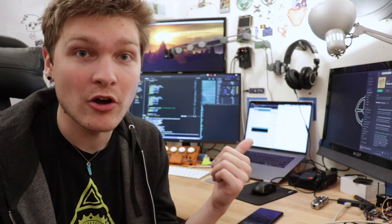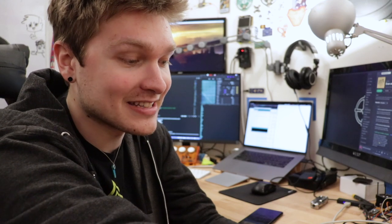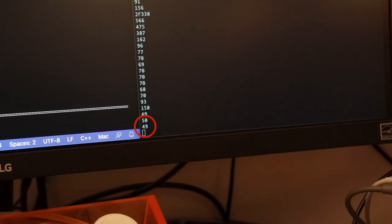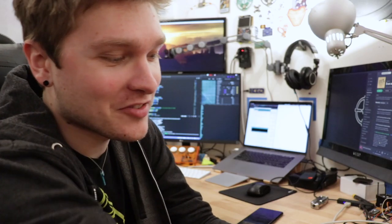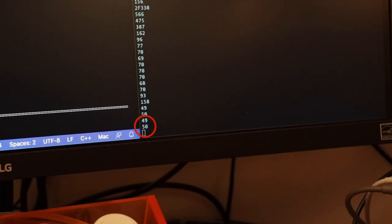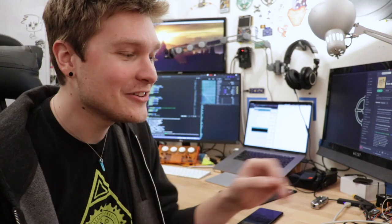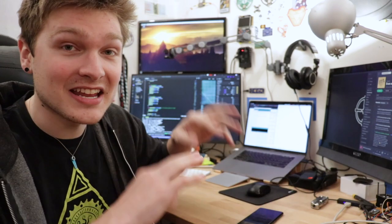And right now I just have the feeder spitting out a single byte over serial of what ID it thinks it has. If I put it on the first feeder slot, it sees that it's effectively 0 volts, and it spits out 49 in decimal, which is 1 in ASCII. But then if I move it over to the second slot, it sees just a bit higher of a voltage, and it gives itself 50, which is decimal for ASCII 2. Then I can use my dummy firmware on the motherboard. I can just send it serial and it'll just barf it right back out over RS-485.